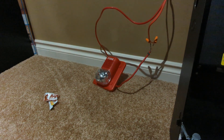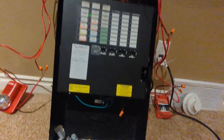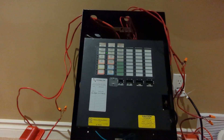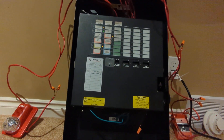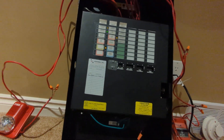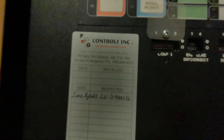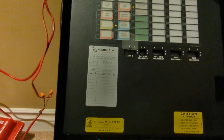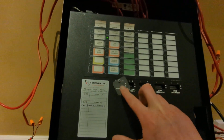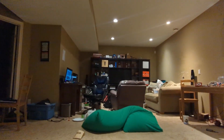The coding is not what you'd expect. I mentioned how these two pull stations are two-stage — that's because these panels can actually do two-stage. I've got this set on two-stage, so it does 20 beats per minute in first stage, and second stage is just typical code 3. These panels program through these eight dip switches, and you use a combination of these to enter a menu, then you can program zones by flipping these up. I'll make a video on it someday. These are great panels — I absolutely love this thing. But obviously it's not addressable, so it's not going on my main board.